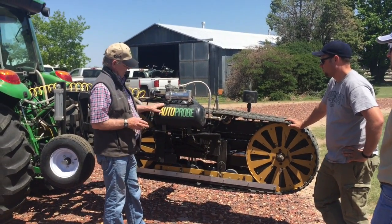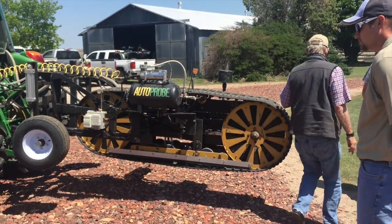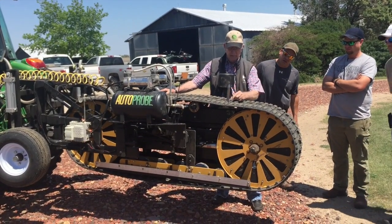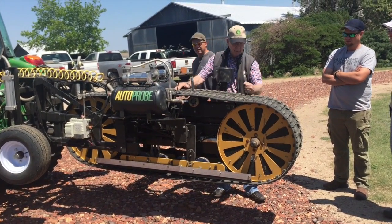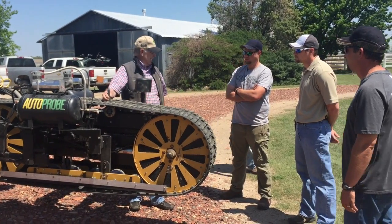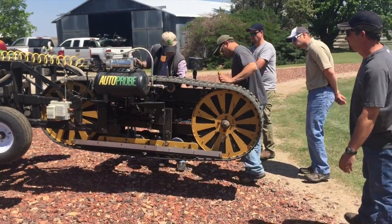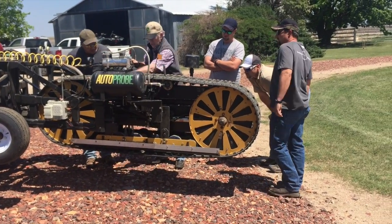Anyhow, the air also has another purpose. Back around here on this side, when this probe comes around the top, it goes across what we call a knockout. It goes up a hill and then down abruptly — up the hill and down abruptly again — like taking that probe upside down and hitting it. That's going into a three-eighths diameter hole into a three-quarter inch tube. So it'll generally break off about right here and the rest of it falls into an auger. This auger runs the length of the machine. This is an auger — you can see the plating on the auger up here. That's augering this way and this auger is augering this way.